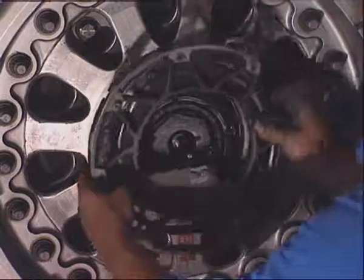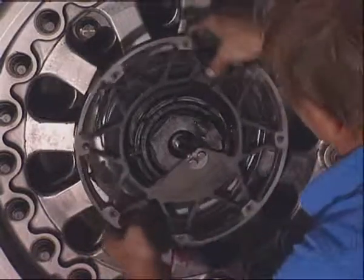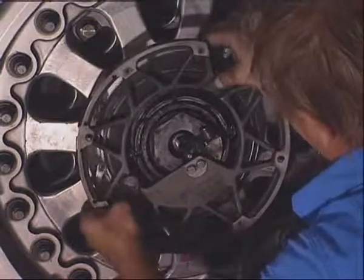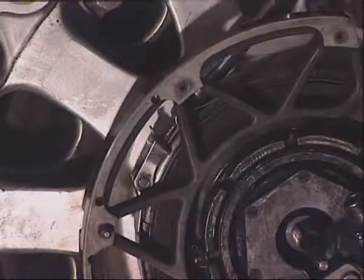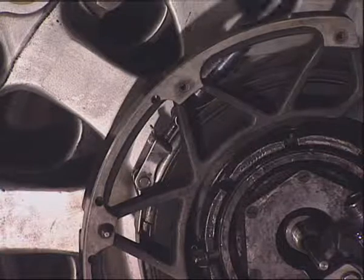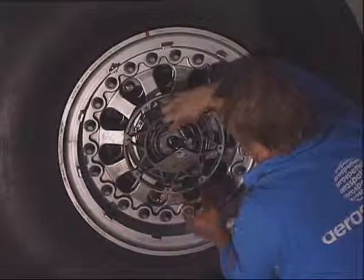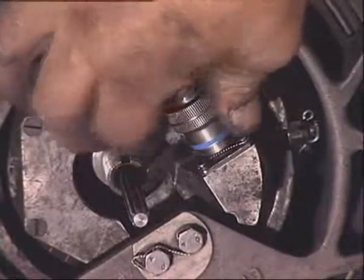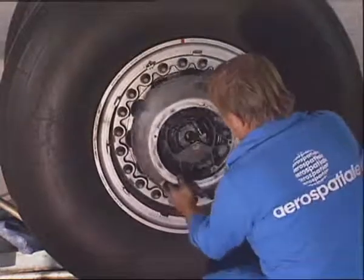Install the shroud support centered by a centering pin and tighten the V-clamp. Reconnect the TPIS sensor plug. Install the shroud with the 2 screws.